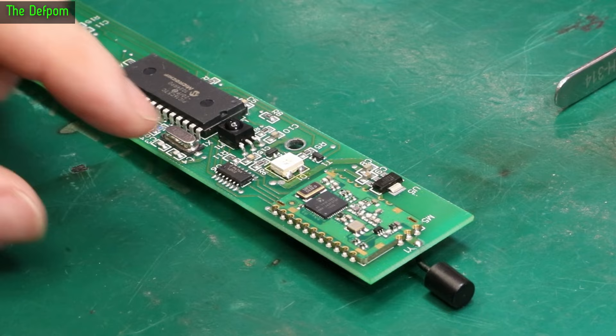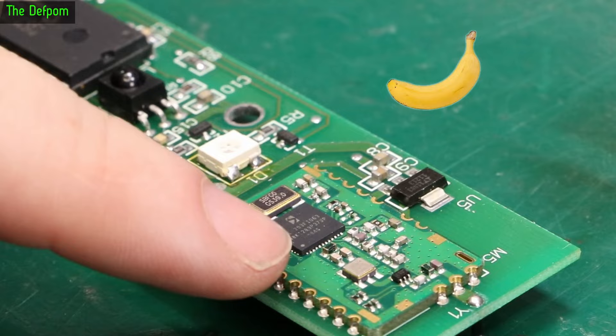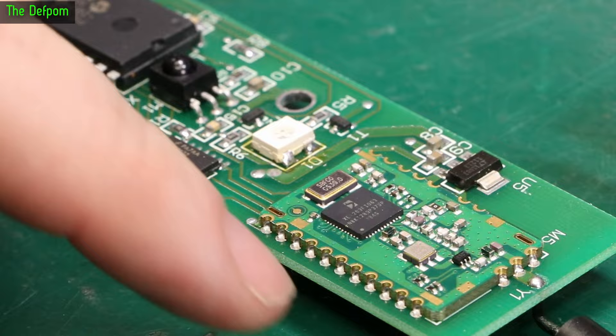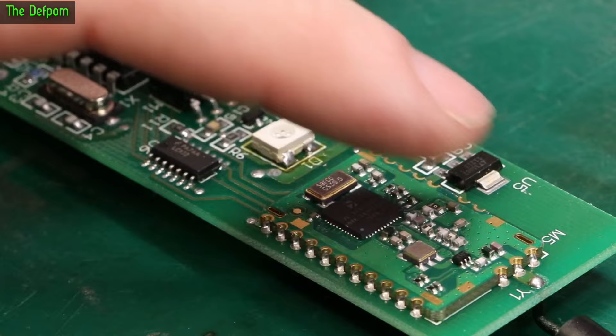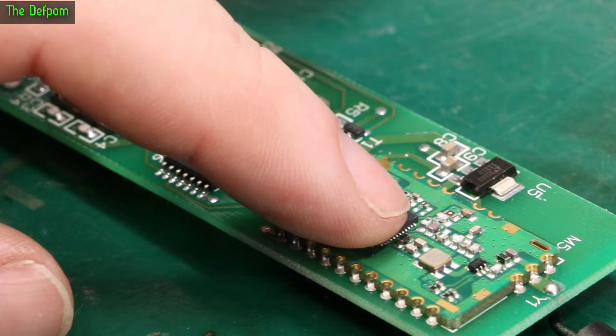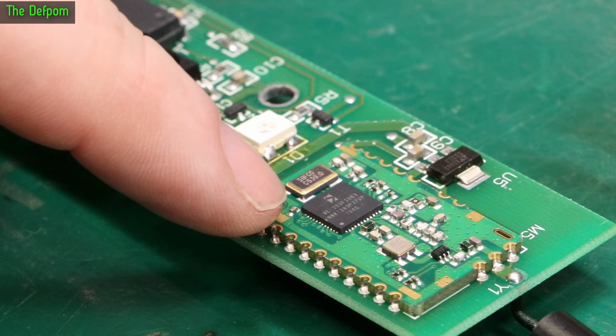So what I'm going to do here — I'm going to take this chip off the board. This is a really small footprint on this thing; I'm not quite sure what the pin pitch is but it's pretty small. So I've got to lift this chip off, clean the pads up, and put it back down again using leaded solder. Maybe that's the problem. Then I'll go around and do the castellations as well around the outside, and that should basically eliminate most of this board. I might just touch up anything which looks a little bit iffy on some of these parts.